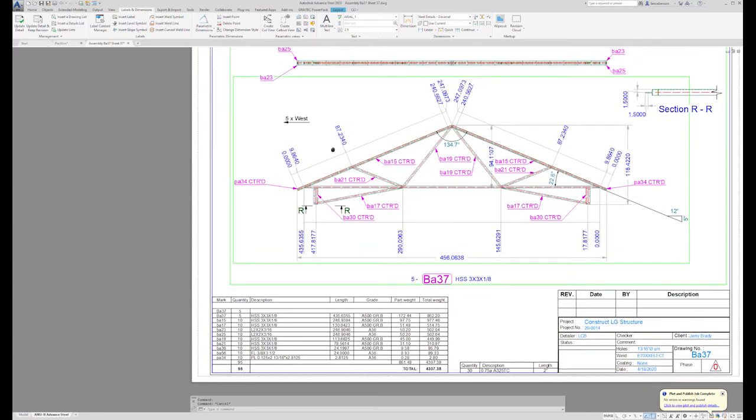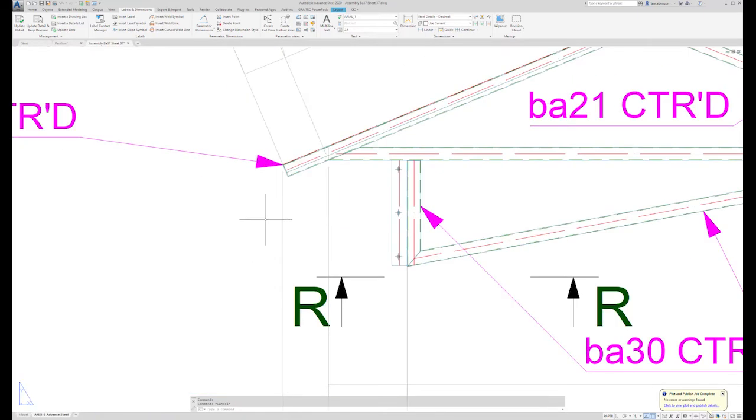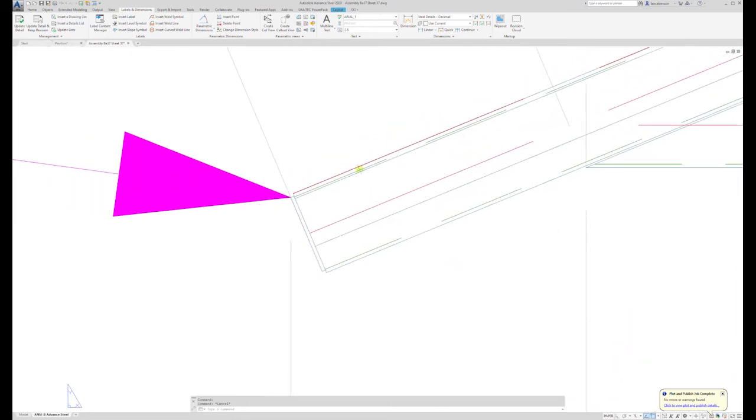9.8640. So the first thing you would do is lay out your marks on the inside of your tube on both this part and this part. So after they're up on your horses and they're clamped down, then you have reference lines to pull your parts to. That being said, I would back up a little bit.